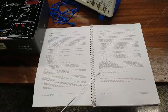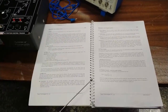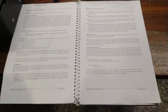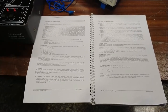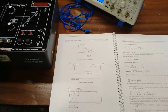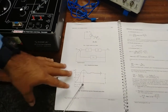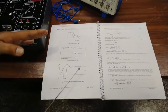We will understand the basic position control of a second order system. The formula for calculating the basic second order equation is: G(s) = ωn² / (s² + 2ζωn·s + ωn²), where ζ is the damping ratio and ωn is the undamped natural frequency. This is the basic circuit diagram. After calculations we will find out the waveform on the CRO — the normalized step response of the second order system — and we will find the XY output of this calculated waveform.